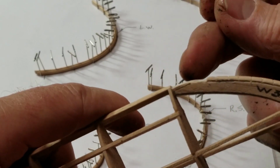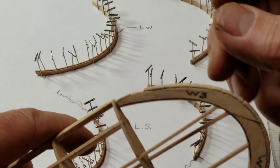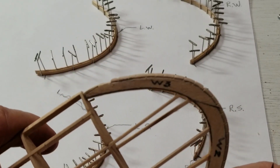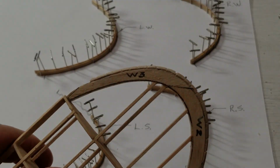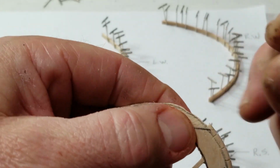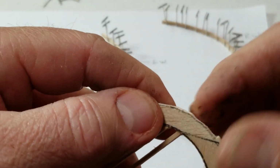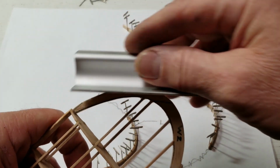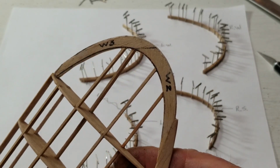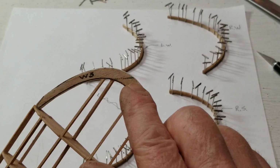At this point, I am carving. I've started to carve out to depth following the line, and as a reference I have these depths of these cuts also so it won't follow the wood grain and take off on me. So I'm going to cut that out on all the wingtips while I'm waiting for these to dry. There is the first wingtip sanded, ready for the lamination. You can just see a trace of my scribed pencil line.